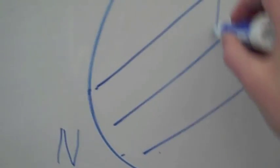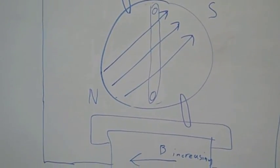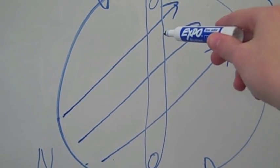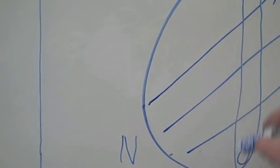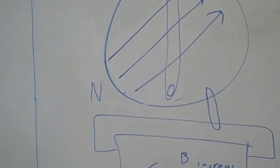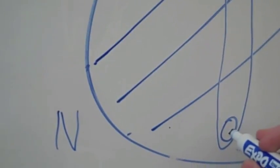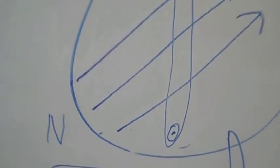Because it's easier to consider a loop than it is to consider 20 vertical bars. This loop is composed of essentially the aluminum conducting ring on top, and then the bars that go from the lower ring to the upper ring. You can use your right-hand rule to determine that the current flowing through this bar would be coming out of the board, and the current flowing through this bar would be going into the board, thus forming a circuit in which the current flows.